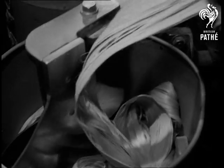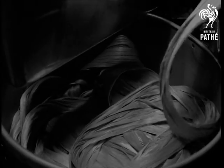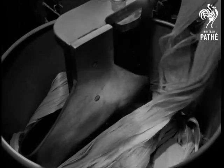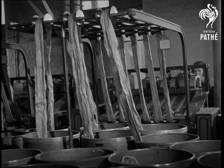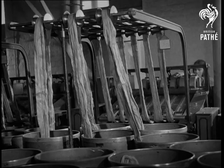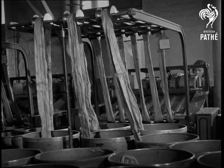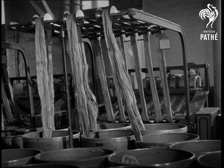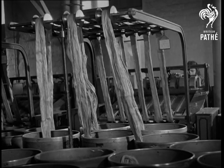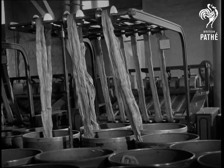This is what happens to the streams. Each is pressed down into a bin. We must now call these long lengths of fibres sliver. Sliver from 6 bins is now taken to feed another machine. This sliver is drawn upwards, over pulleys, passes to the right, and then down again.